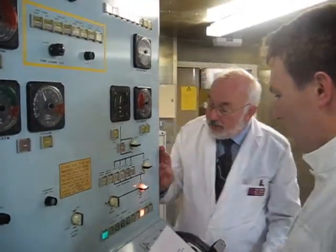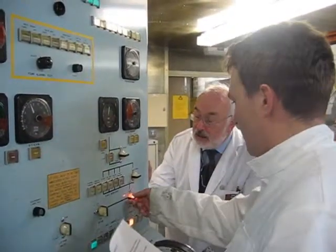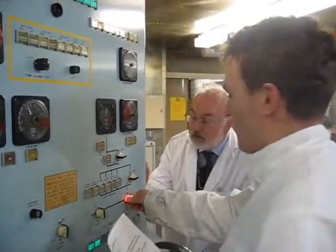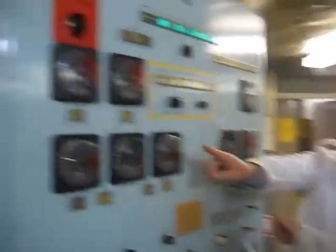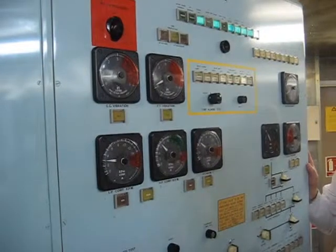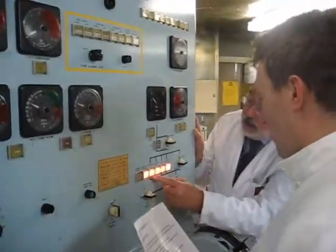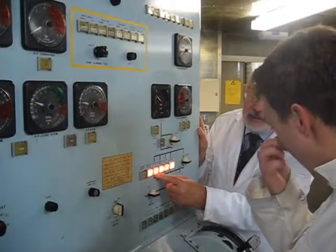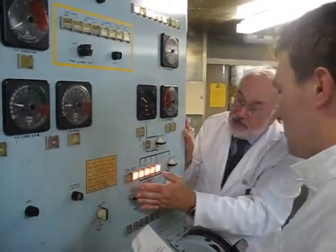It's still running. So what we now do to shut it down is we get a hold of the switch, we push it in, and cock it to off. And release. We're now getting positive spool rundown. We do an interlock check — HPSOC closed — so we know the engine is definitely going to stop. Positive spool rundown, we're happy with that.